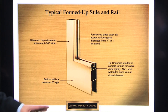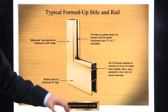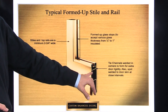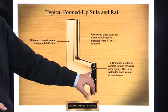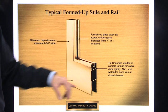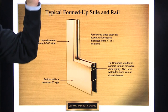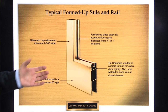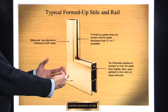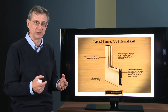The secret to this kind of door construction is what's called a tie channel sub-assembly. What you're seeing here is this little U-shaped portion inside — that's the tie channel that goes all the way around the vision opening. It's a sub-assembly of channels that are welded in the corners, then slid between the skins of the door, positioned, and spot welded or resistance welded into place.